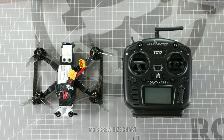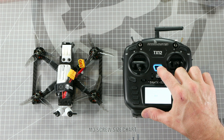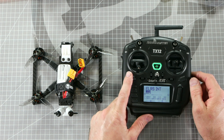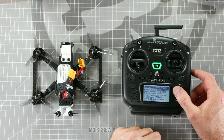To bind the receiver in the drone to the ELRS transmitter in the radio using the 3-plug process, you'll first need to power on the radio, make sure all warnings are cleared, hold the SYS key, use the scroll wheel to scroll down to Express LRS, and click in on the scroll wheel to select. Then rotate the scroll wheel to the right to scroll down to bind.